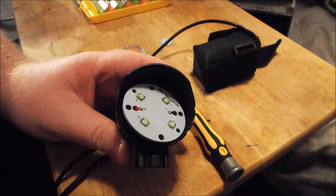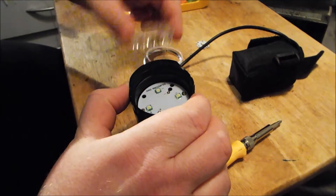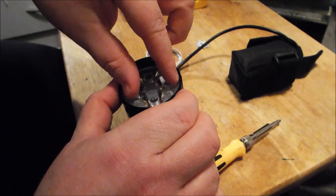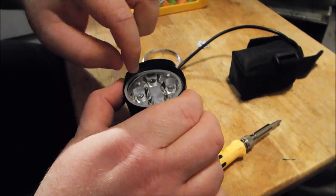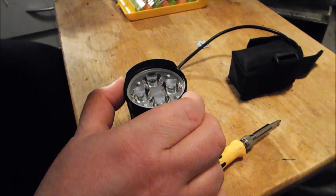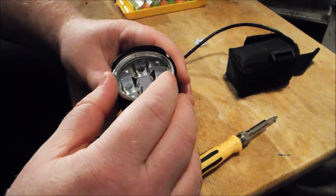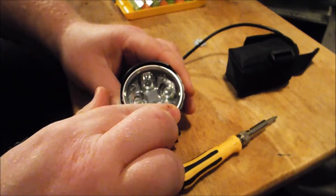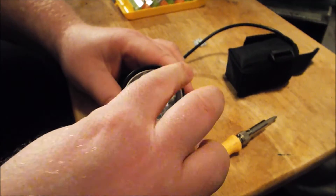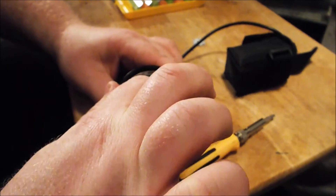I'll put this back together and we'll continue the video. These are the optics here. Even if you wanted performance increases and didn't want to spend too much money, and you've got intermediate knowledge of flashlights — go out and get some XPG3s. They can be had fairly cheap and they're more efficient than the XMLs. Without touching the driver you're going to get more output with the same amount of heat from the same amount of power, because the XPG3s are so efficient — I think it's like 190 lumens per watt.